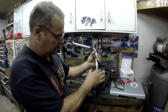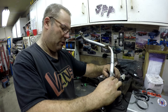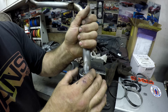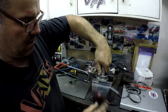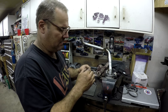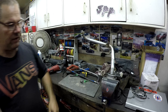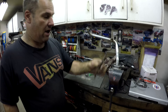So there it is, it's on there. The two halves are slid together — not just butt welded, basically factory style. Because this tube is not totally round, when I banged it in there it conformed itself perfectly to the shape of the tube. We're going to weld it rather than solder it. When I did mine before I butt welded it and had pinholes to deal with, had to keep pressure testing it. This should be way better because it's like part of it now. Then we'll have to cut this bracket down and get it welded back on — put it on the engine, mock it up, and weld it on.